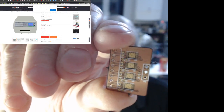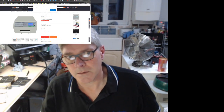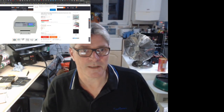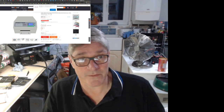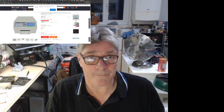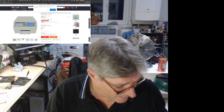And this fits up to four one-wire cold junction compensated thermocouple interfaces to be able to read not only the two thermocouples that are already in the machine, but you can add another two if you want to. You might want to have one that hooks onto the board, for example, or one that hooks onto two places on the board if you want to be really aware of what the temperature is in there. And then you have to also upgrade the firmware in order to support that.